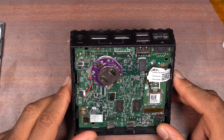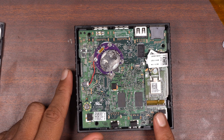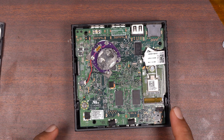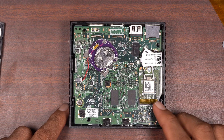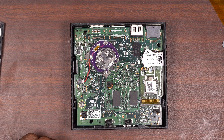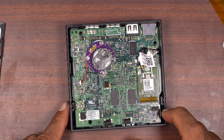I'm guessing that chip is either an SPI flash or the ethernet transformer — probably the ethernet transformer looking at the pinout. That's your memory, two gigabytes. Here's a WiFi card, and the fun thing is it's not a generic WiFi card — it's very specific to this board. There's no USB, no PCIe, or any common easy-to-use interface on this header. It's directly SPI, so that's a WiFi-over-SPI card — WiFi and Bluetooth. If this breaks, you can't get an off-the-shelf M.2 or mini PCIe WiFi card; it won't work because it's not USB, not M.2, not PCIe — it's its own proprietary thing. And I'm guessing there's the clear CMOS button right there.